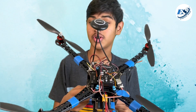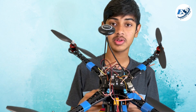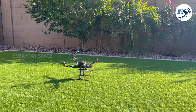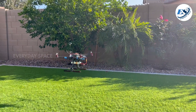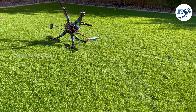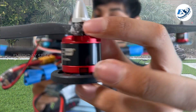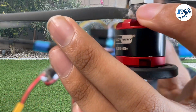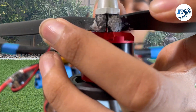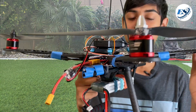That is pretty much the basics of all the drone parts I have on this drone, and as you can see, it's not done, so I'll probably give you guys another update when it is fully done and doing autonomous flight. Here you can see that after many countless hours of testing, all of this led to this one moment — my first real trial of whether the drone would fly or not. As you can see, it lifted and then this happened. It's very unfortunate because this was my first trial run and it didn't go according to plan. If you can see here, there's a tiny crack in the middle, and the gray stuff you see around it is putty I applied trying to fix it, but it didn't really work. I was also thinking of 3D printing the entire propeller, but I wasn't sure if it would be efficient enough and fly as well as the rest of them, and I'd have to replace all four propellers, so I didn't think it would be worth it.